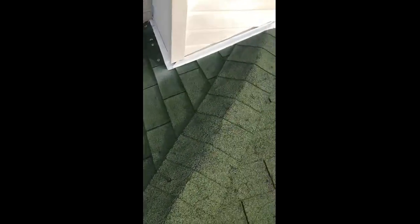Here on the front porch area you can see how deteriorated these shingles are, with all the cracking and granule loss. Nails are popped through at various locations. Shingles are missing over here.